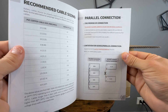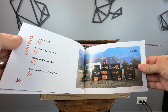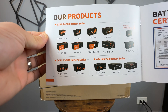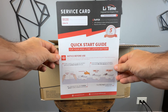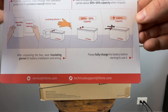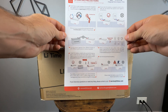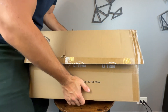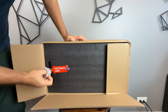This battery has 3072 watt-hours of usable energy, making it a workhorse for any off-grid power solution, but it can also be used for many other applications. It can deliver up to 120 amps continuous discharge and can handle a peak of 350 amps for five seconds. This is important for high-demand applications like golf carts or heaters that have a high initial draw — meaning this battery can provide 6144 watts of continuous power for energy storage applications.